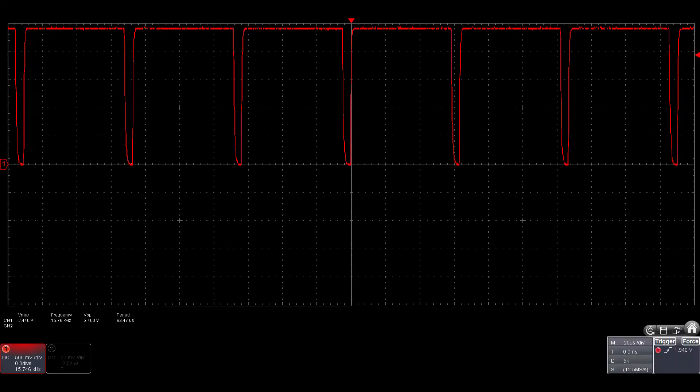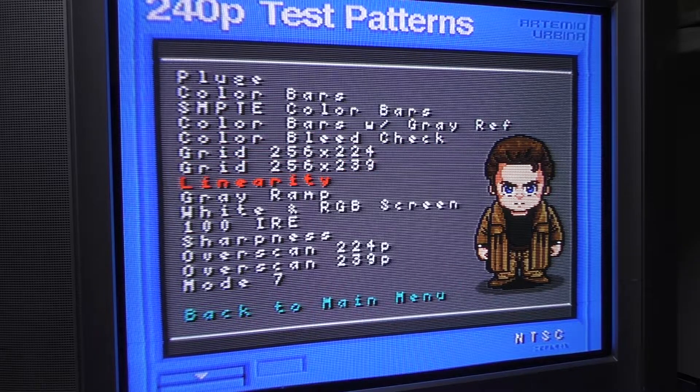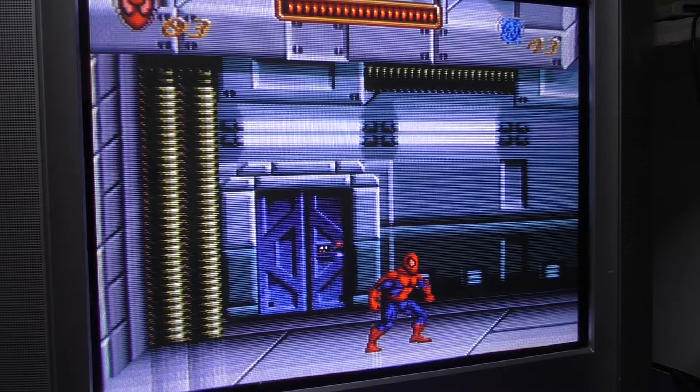This measurement uses the very bad power supply. The next picture uses a very good USB power supply from Panasonic, and as you can see it enhances the signal just a little bit. Next I used a full color background test — a red screen — and as you can see the original picture with no switching and the picture through the SCART switch are really identical with no real difference between them.